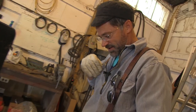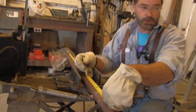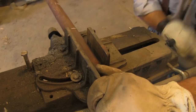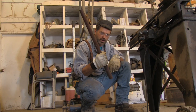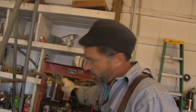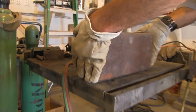You may not start out as a barbarian, but by the time you squat with this thing, you're going to be a barbarian. We're going on to the handle now. We're going to make this handle 26 inches long — six of those inches will be lost inside the hammerhead. This pipe is 3/16 by 1¼ inch, which makes a good handle hold. We don't have an inch and a quarter drill bit — that's a big, expensive drill bit — so we have to put a hole here using one of my favorite tools: the oxy-acetylene torch. We're going to cut a hole with the torch, slip the handle in, and then weld it on the inside. After that, we're going to weld the caps on and do some grinding.